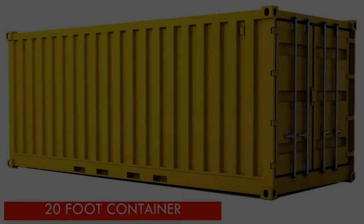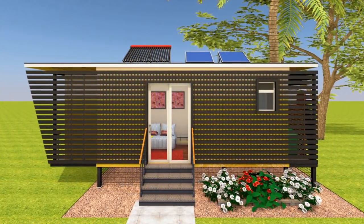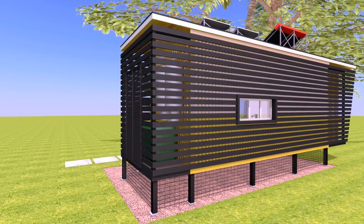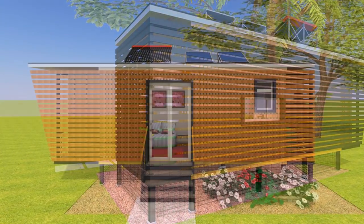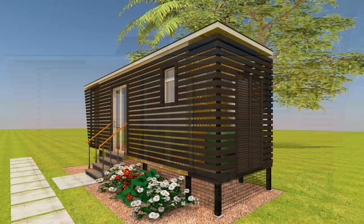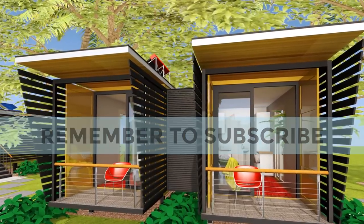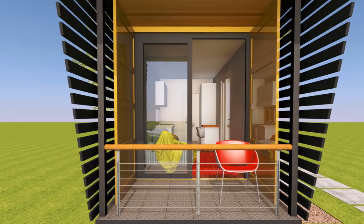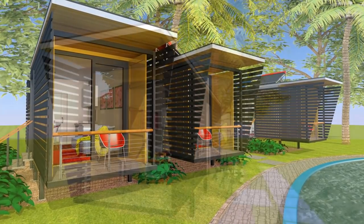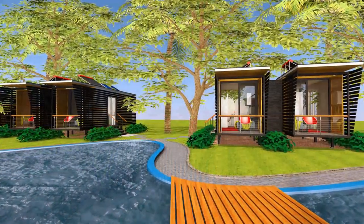On the structure and modification, each cabin is designed from a single 20-foot shipping container. The containers are used in their purest form and almost no special modification is done except cutouts for the kitchen and bathroom windows plus the main entrance door. All doors and windows are optimal in size, so there is no need for additional structural reinforcements. Every cabin design retains the original container cargo doors in an open position, used to create a Juliet balcony fitted with full-height sliding glass doors, providing access to the outdoors and maximum daylighting, seamlessly connecting the living space to the outdoors.